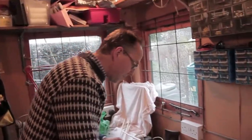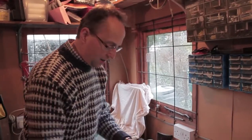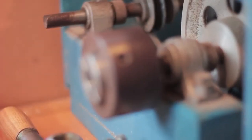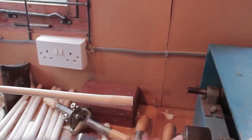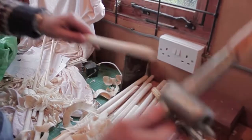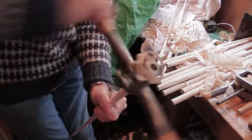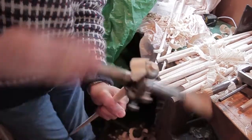So that gives us a rough shaped spindle and now I'm going to take it out of the chuck. I've been turning this at about 200 rpm and I have this very simple chuck arrangement — just literally two halves of a bit of metal that grips it. Using a half inch one, I'm just going to do this by hand now. This will be the end that goes into the wooden chair seat.